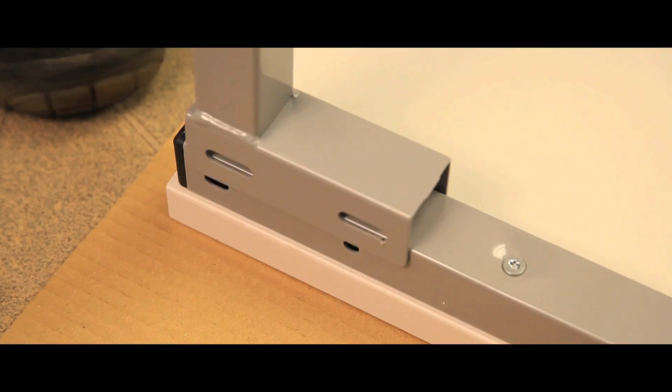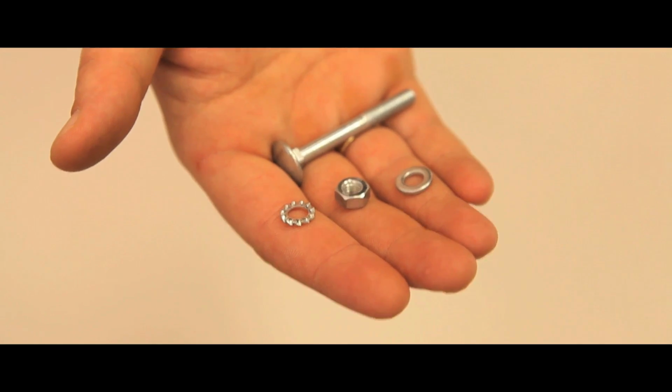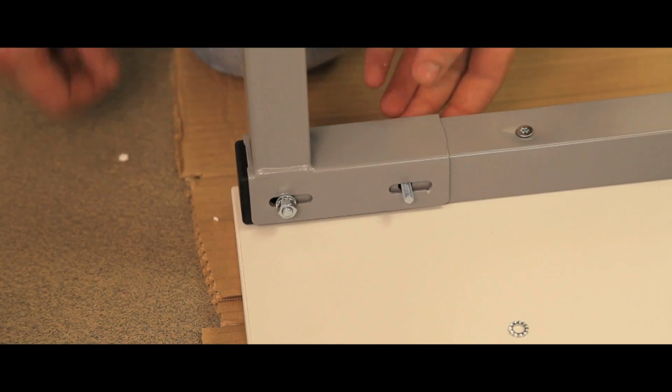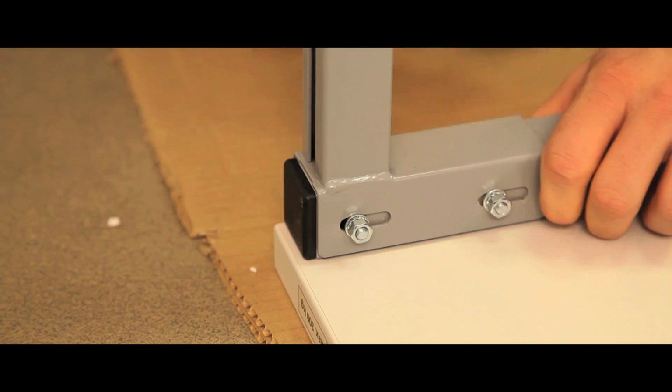Locate the 4 angle leg brackets onto the bench cross members using M6 bolts, washers and nuts. Note the 1 leg bracket with a yellow safety sticker should go to the front. Line up the end of the brackets with the black bung in the worktop frame and tighten the nuts.